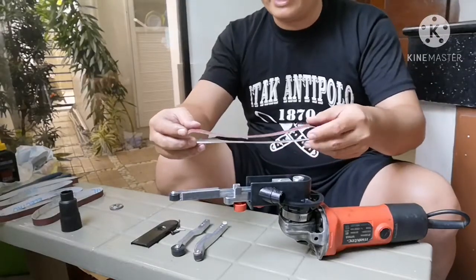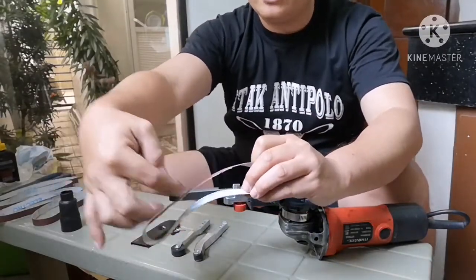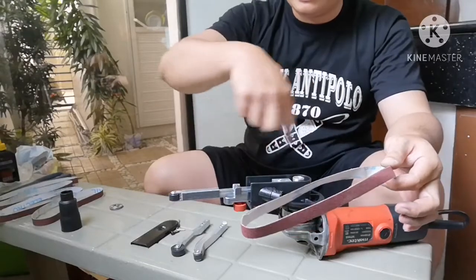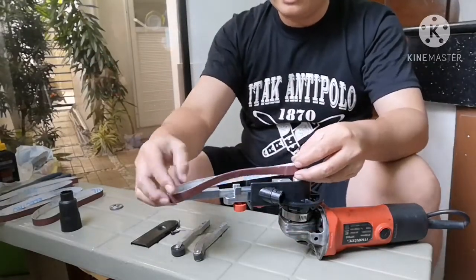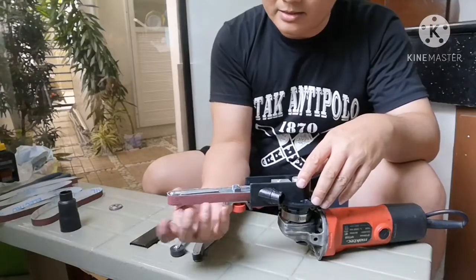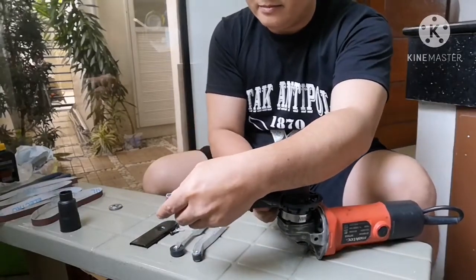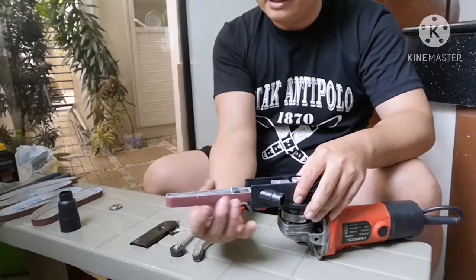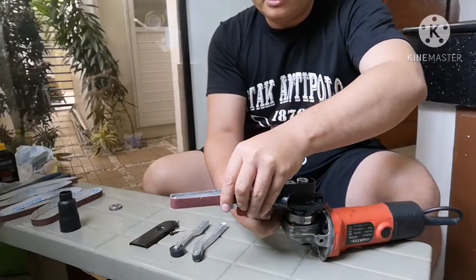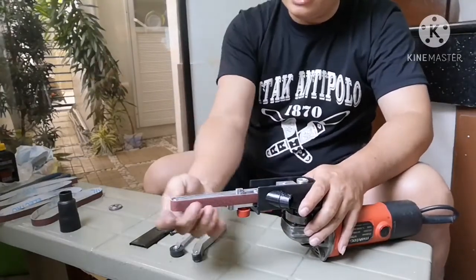Pull this back by pulling this lever upward, and then we can put the belt on. Make sure you take note of the direction of the belt — the direction for this belt is this way. The turn of the grinder is this way, so it has to be placed accordingly. Then gently pull the arm upward so it tightens the belt. You can feel the tension and adjust so that the belt turns firmly. You can see it working already.